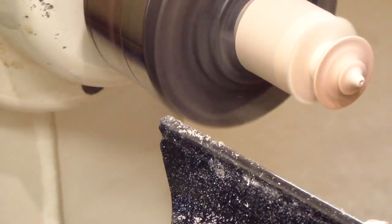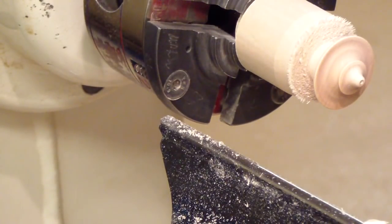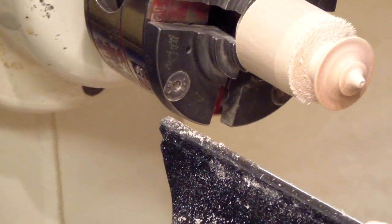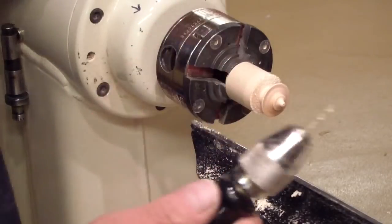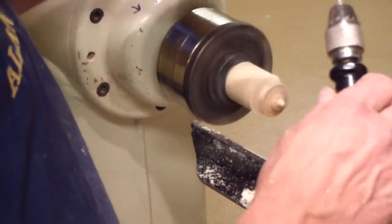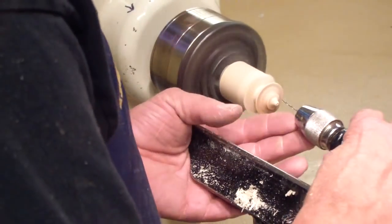And then, head it out. Both tenons are 3/4 of an inch, right? Oh, it's right here. Both tenons are 3/4 of an inch, right? Maybe. If I banged into the side when I was hollowing, that one's going to be bigger. And mine is 5/8, not 3/4. And then I'll slow the lathe speed down. So you can use vice grips to hold this guy. Or I bought one of these from MSC.